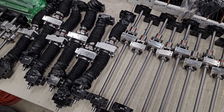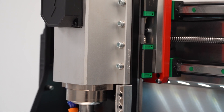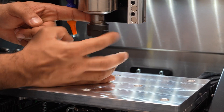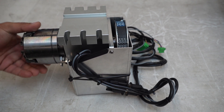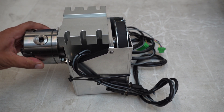The machine comes with a 24,000 RPM 2.2 kilowatt ER20 collet spindle that features very low runout and high quality thrust bearings in the nose to handle high radial loads when cutting metal. We'll talk about the fourth axis in a bit, but it's basically a bolt-on accessory that's plug and play with the five axis breakout board that the machine comes with.